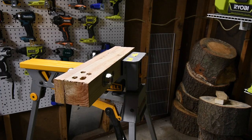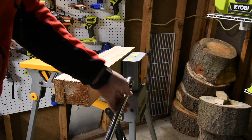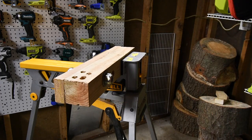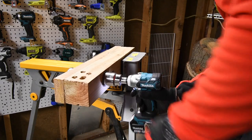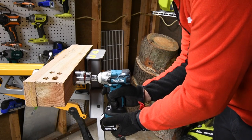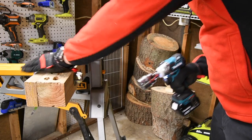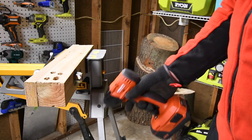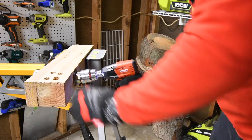Let's do a torque versus test. I have the torque bar set up to 110 foot-pounds. Remember to work with gloves and safety glasses. Note: this is not an impact-rated socket. Battery is full on the Makita — let's see what it can do. It cannot do it. For some reason it cannot, because even though it's 110 foot-pounds of torque, it's a huge inch-and-a-half nut. Battery is full on the Hilti on speed three — it cannot do it either.